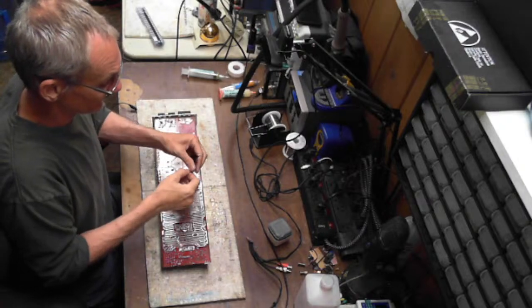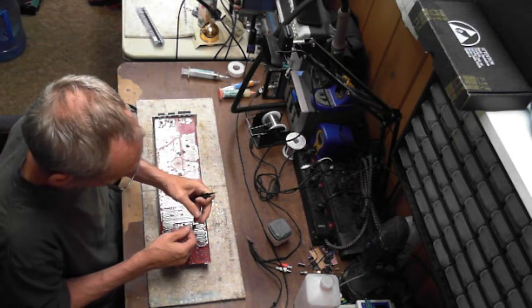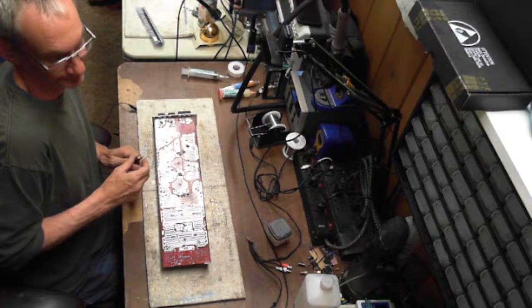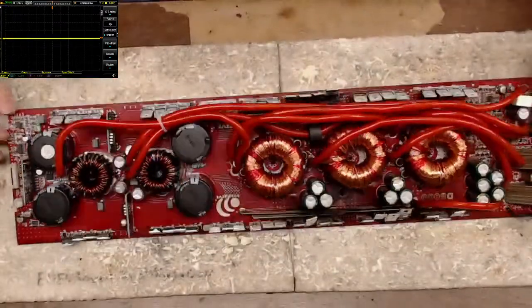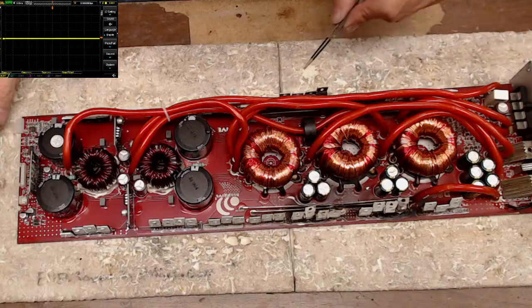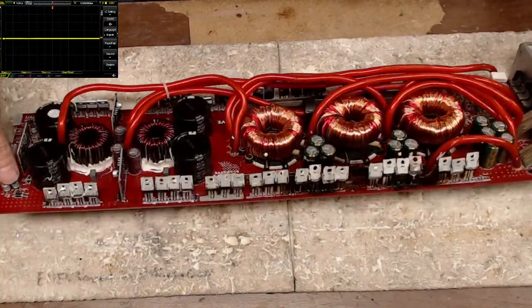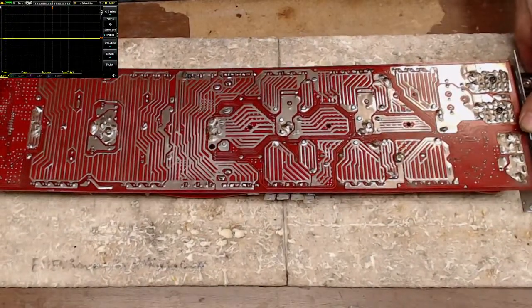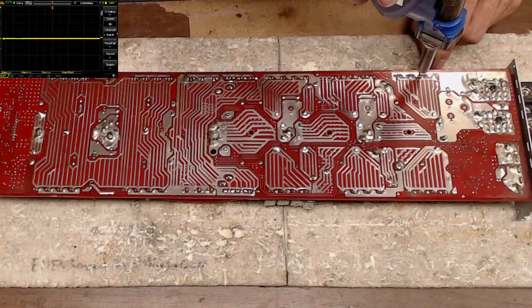So the power supply transistors in this are the IRF 1018Es. Well, do I carry those? No, I don't. So what we have here is one, two, three. So you're gonna have 6 banks of the IRF 1018Es. I will have to look at a data sheet and see what the specifications are of those 1018s. I think, I can't remember. I looked them up. I think Mouser has those in stock. Someone has them.